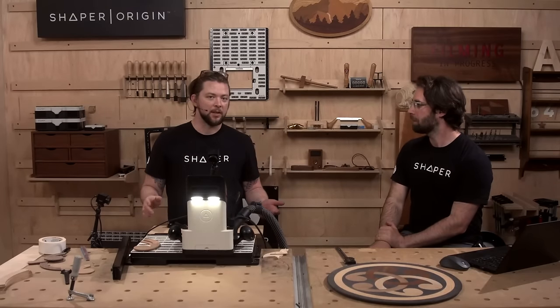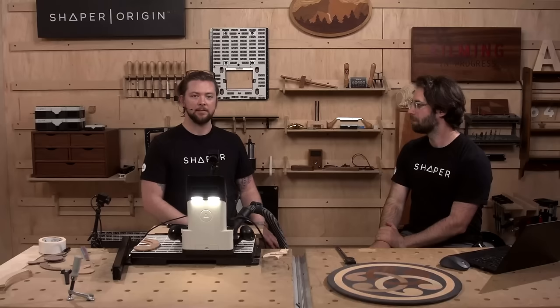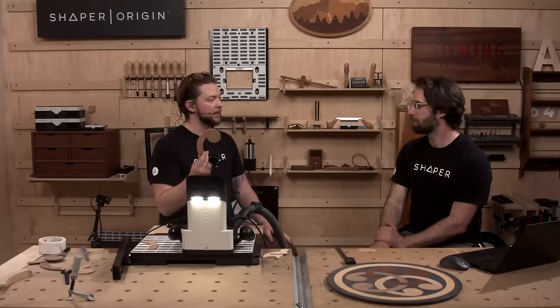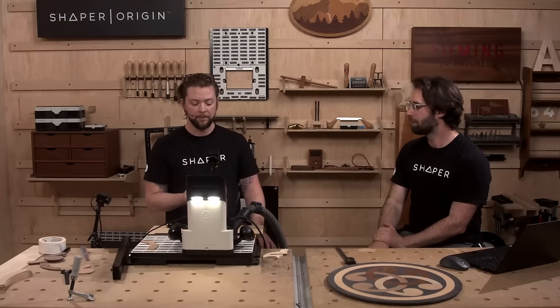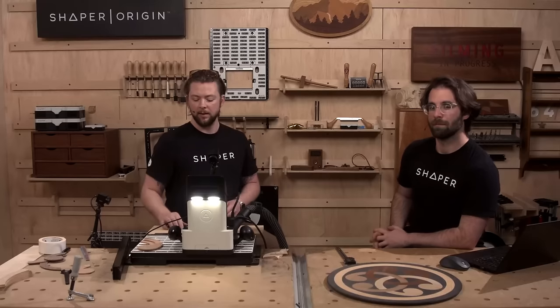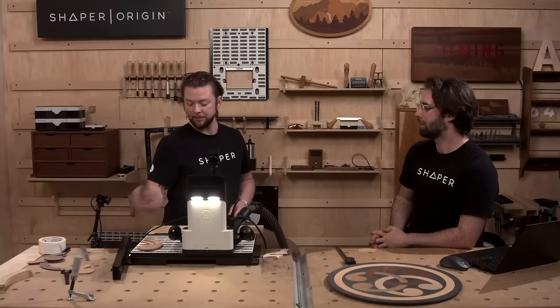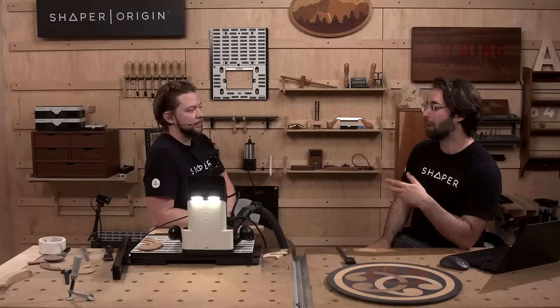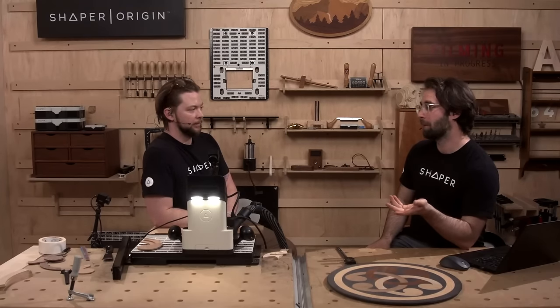Typically here we're doing 1/8 of an inch just because it's nice and easy. It's stable too. When we're prying it up, it's less likely to split on us. You still want to be cautious of what direction the grain is going, but that's where the putty knife comes in. And then on the extreme end of the spectrum, we have commercial veneers, that 1/2 millimeter thick veneer.